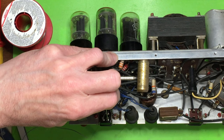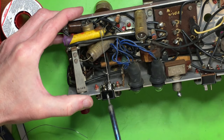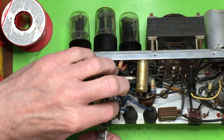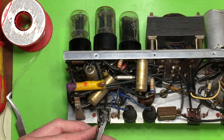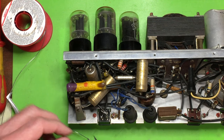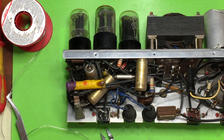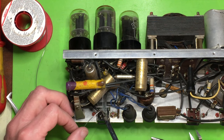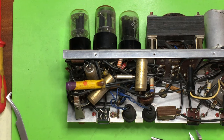Connector pins are already well tinned, so reflowing it does make it quite a nice joint. And I can now just cut that back. Try not to burn my knuckles on the connector. And match it to that original wire a bit higher up. Oh, lower down to it, will it? I'll redo that when I get some sleeving and put a new piece of tin wire on it.